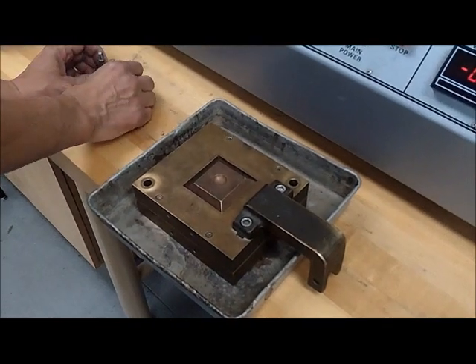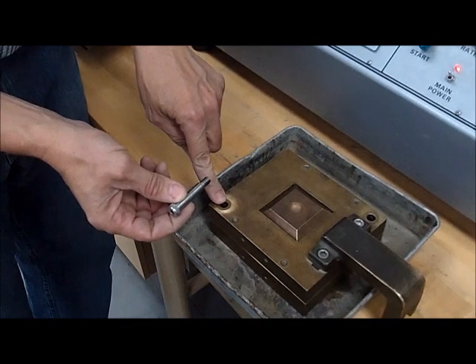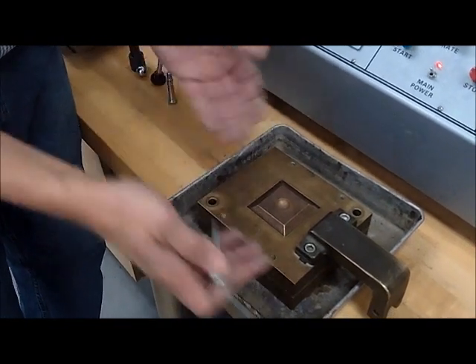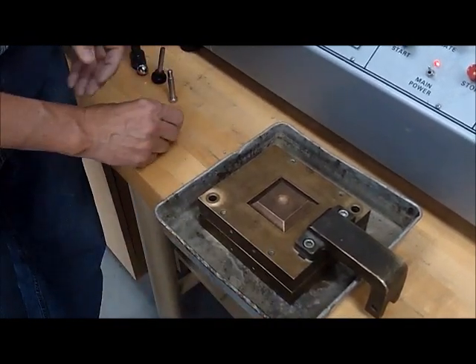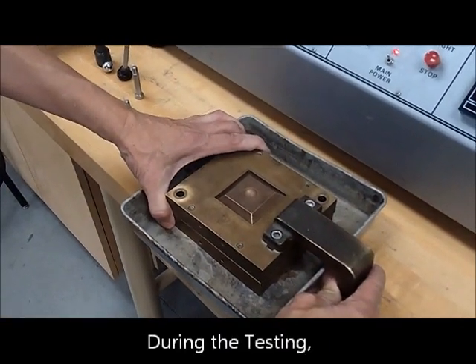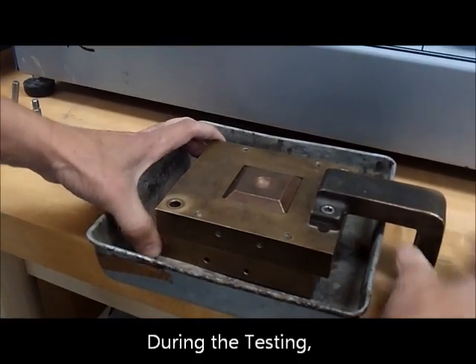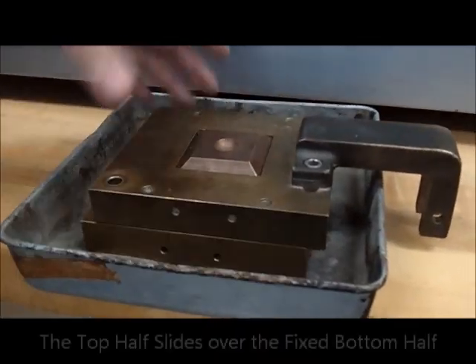These holders only have the purpose of assembling the box together. But during the test, we remove them so that the split box can actually shear. This is what is going on when you shear the sample — the bottom stays fixed and you are shearing the top.